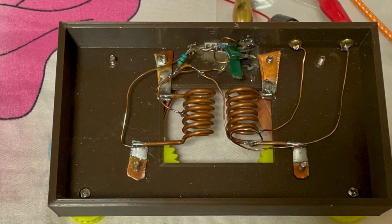Underneath there is the 50 pF capacitor that does the coupling between the primary stage LC and the secondary stage LC. On the right you see the white socket that connects from the diode to the remaining circuit. You have two green capacitors — they are the main capacitors, 2000 pF. And then underneath there are two 47K resistors.